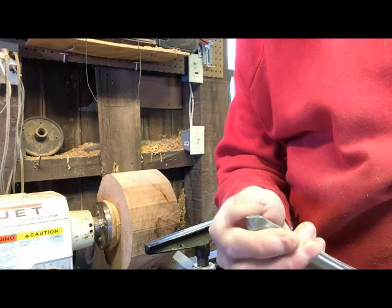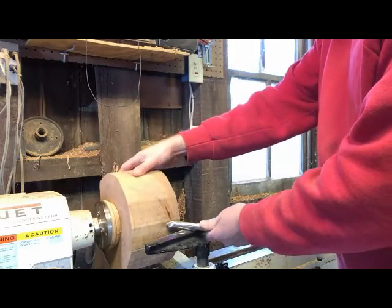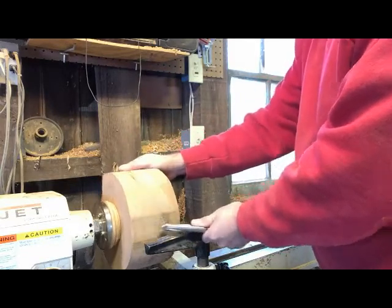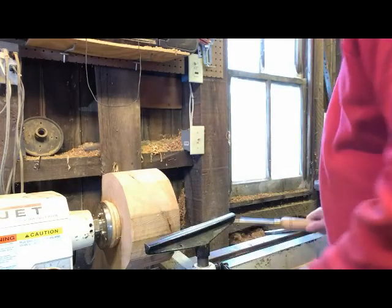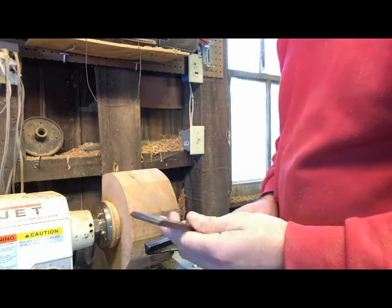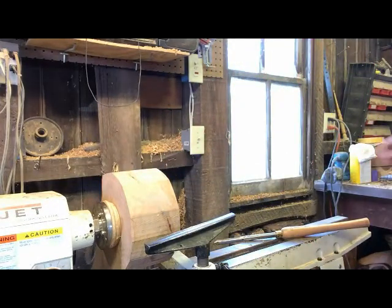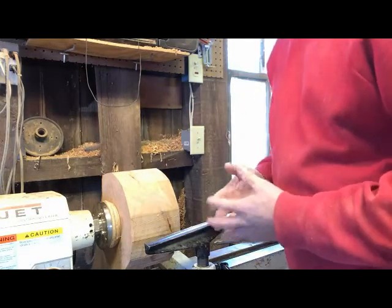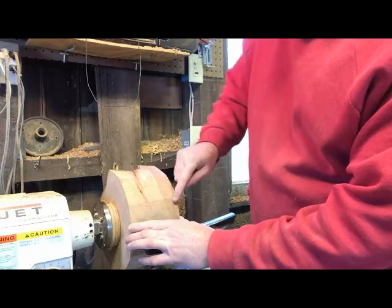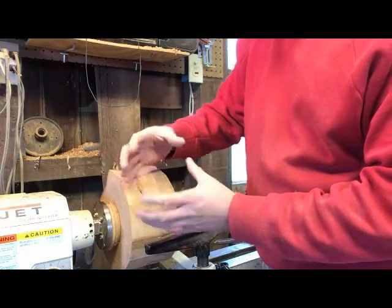As the wood is coming toward me, I am cutting into the wood. As the wood spins, this chisel will take off little bits of the wood as it comes toward you. My goal is to get it into a uniform shape. Then I'll use other tools including a scraper tool and another type of skew, and I'll make this into the shape I want. The question I always get asked is: do I know what shape I want to make when I put the wood on? And the answer is not really. This bowl — I think I'm going to try and make something a little rounded on the top, like an oval kind of shape. But I'm really concerned to see how this holds together first, because depending on what this crack is going to do, that will determine the shape.